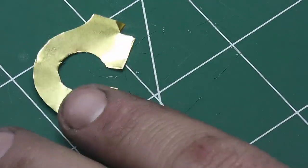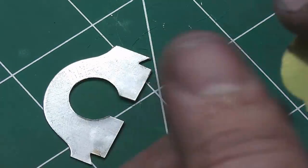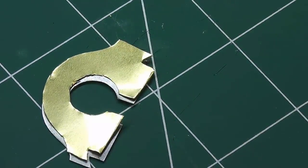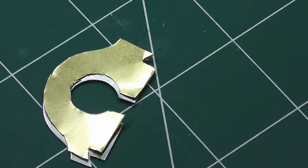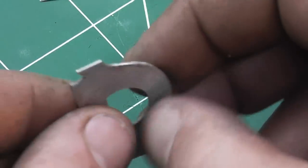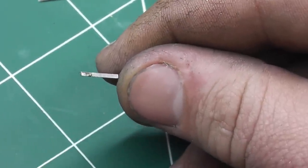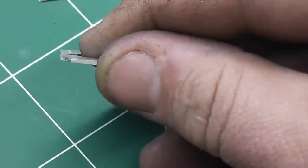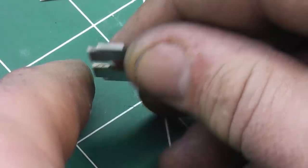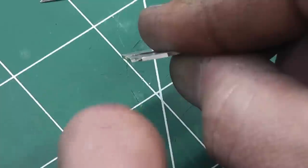And there we go. There's our shim. Now we're going to put that in the stack and recheck our spindle clearance. One important note, the larger shim, if you look at it, see the edge? See that bevel on the end? That's from the spindle. You want to put it back in line with the edge of the spindle. In other words, you don't want it flipped that way where that's going to dig in. You want it that way, right against.